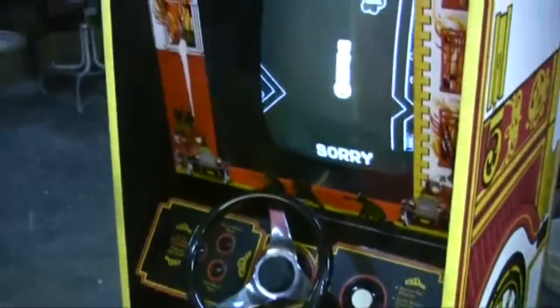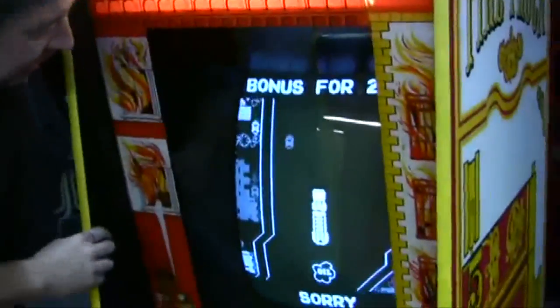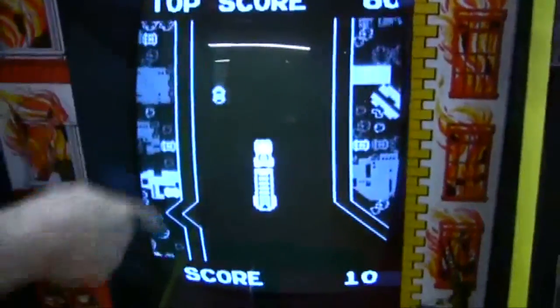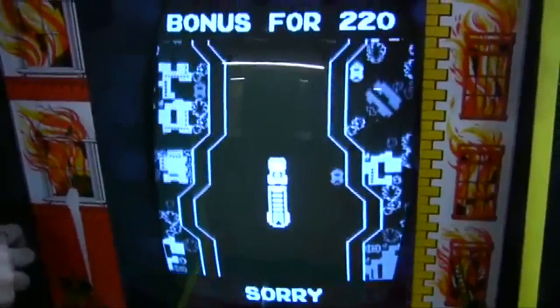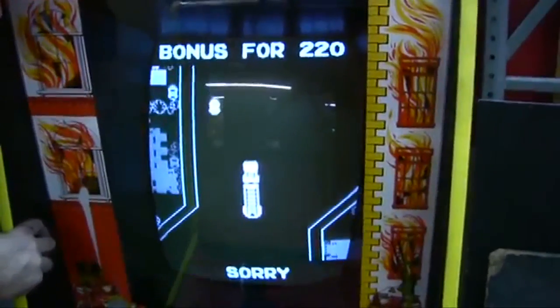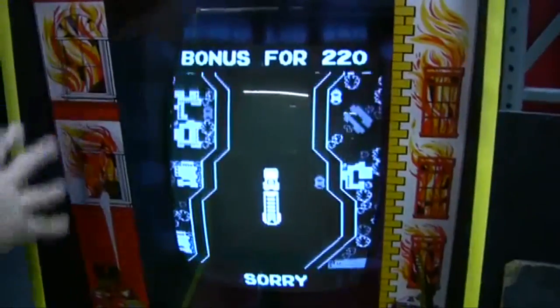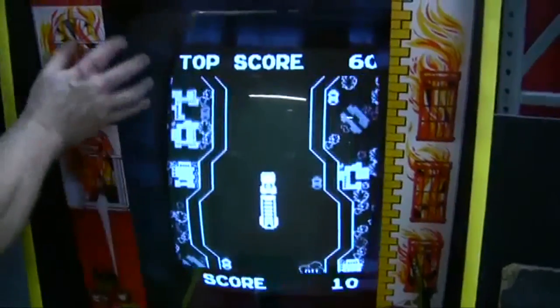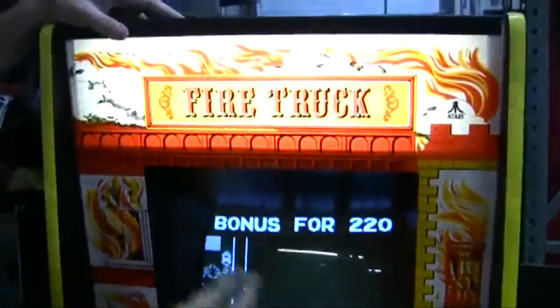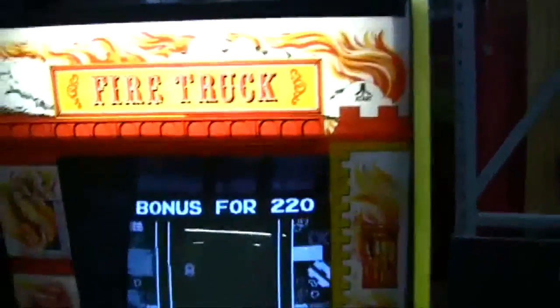It's not very exciting, but the technology is unbelievable. Look how crisp and clear the black and white picture is. This is a 23-inch Motorola monitor, and it's still in surprisingly good condition. We've cleaned the chassis, reflowed tons of cold solder connections on it. The original monitor plexiglass is in beautiful shape. We were surprised at how nice it cleaned up, weren't we, Frank? Yeah.